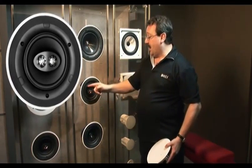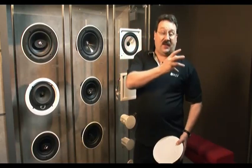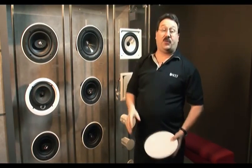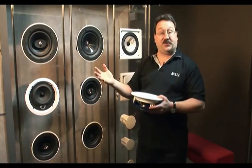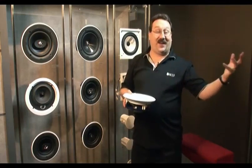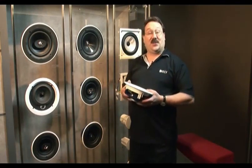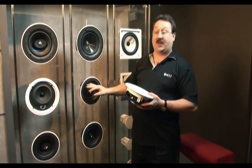This unit uses two tweeters and a dual voice coil woofer and has two inputs. When you have a room like a bathroom where vents, lights, and heat lights leave no room for two speakers, sometimes you discover there's not actually a place to install two speakers. But with a stereo whole-house music distribution system, this dual stereo speaker lets you play stereo from a single location in the ceiling, allowing you to enjoy that amazing KEF stereo sound even when you can only fit a single loudspeaker.